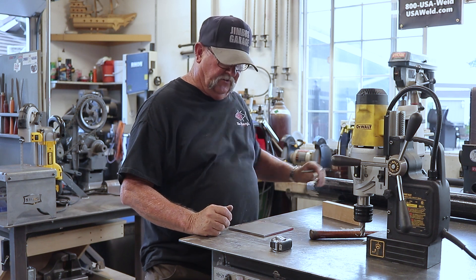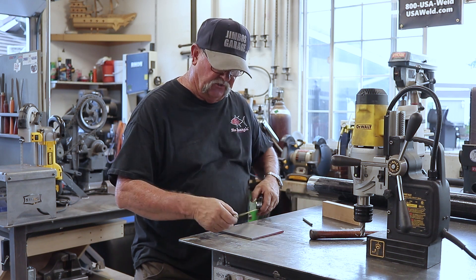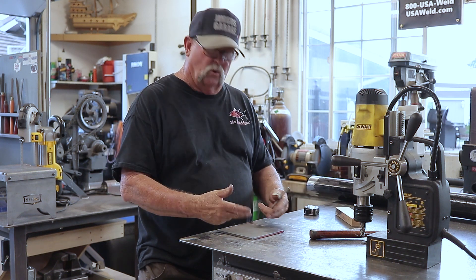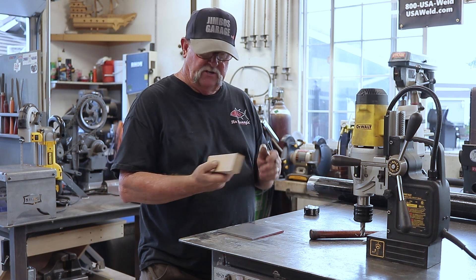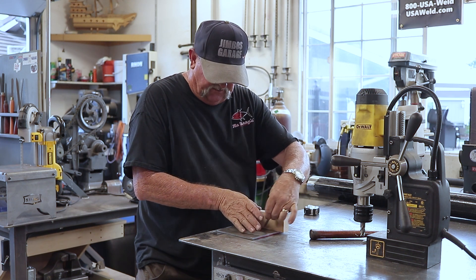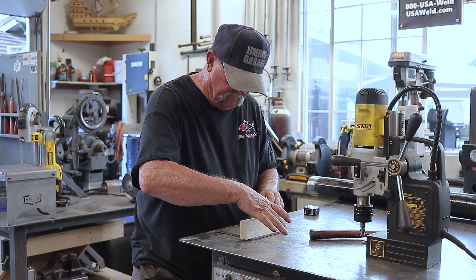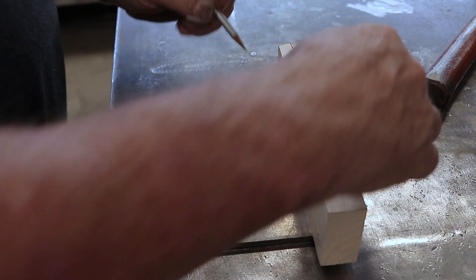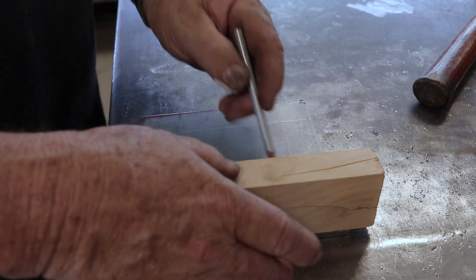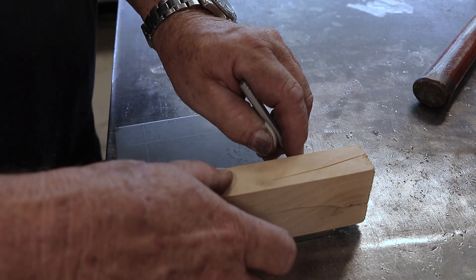Now that I've got that all ground, I've got the six inch square plate, quarter inch thick, and this thing is exactly square. I need the holes one inch in from each corner, so I've got a piece of one inch wood stock right here. I'm just going to hold it on the edge of all four sides and mark that — fairly simple. Once I get this all marked out all the way around, I'm going to take my center punch and center punch the intersections.